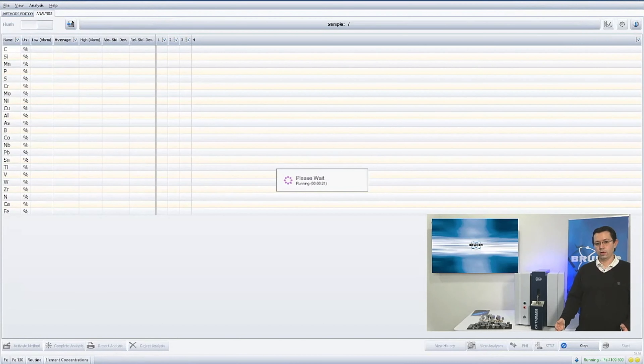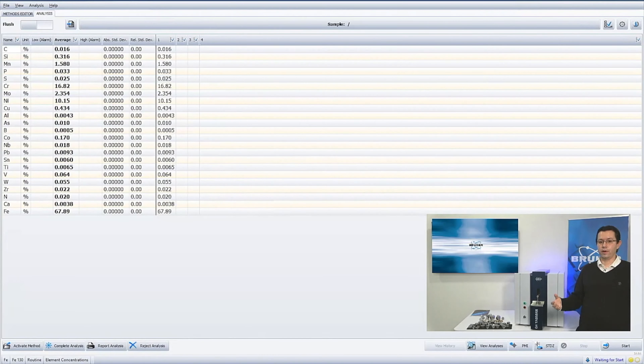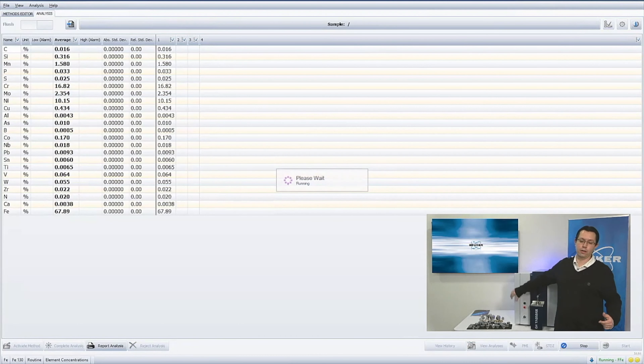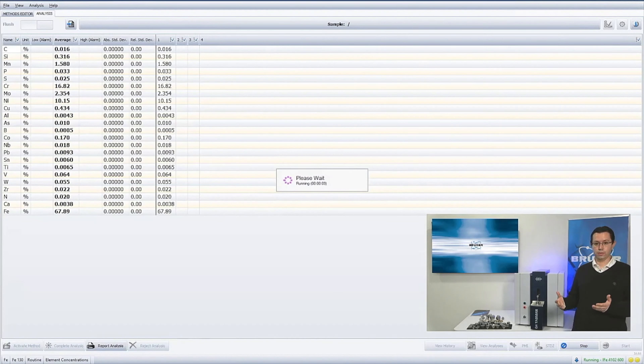OES is a reference analysis technique for metals. Metals are divided into two main groups: ferrous and non-ferrous. Non-ferrous includes aluminum, copper, tin, lead, zinc, and so on. Ferrous is by far the most common metal — iron — and is further divided into steels and cast iron. Steels break down further into low alloy and high alloy steels, with high alloy steels including stainless steel. Today I'm showing a stainless steel sample — a steel with high concentrations of chrome and nickel and various other elements.